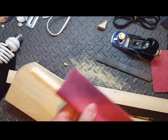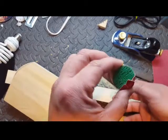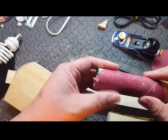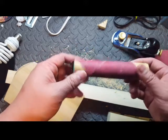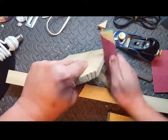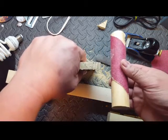What I also did — I found one here — it's about an inch and a half dowel. I took some 80 to 100 grit sandpaper, wrapped it around at a 45 degree angle, then sprayed some spray adhesive on here and stuck that on there. What you can do is just hold that and then go inside those corners. For larger ones, you can get some two to three inch pieces like this. If you don't have a spindle sander or something, this is definitely a lifesaver.